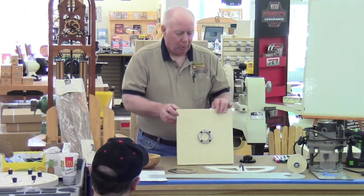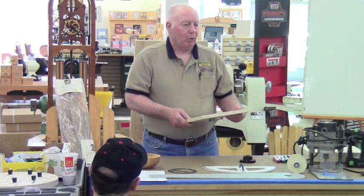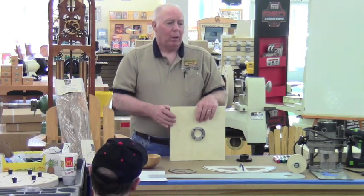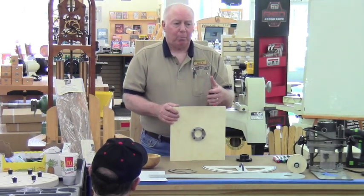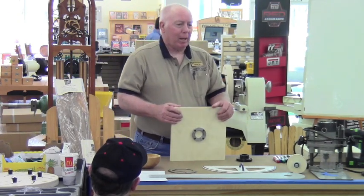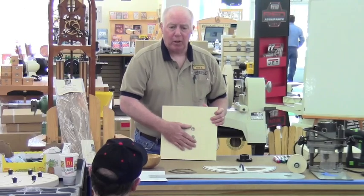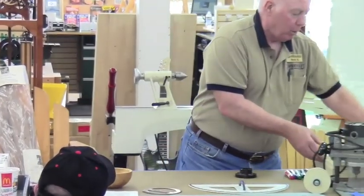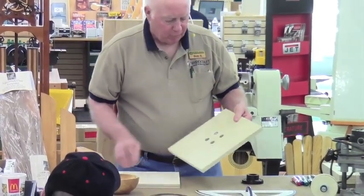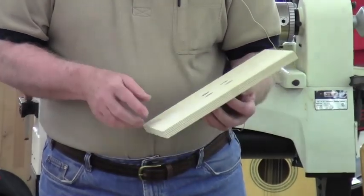We're making these things out of Baltic birch plywood — you'll find plywood with about eight jillion different layers in it. When you fasten one of these devices to your wood, you can use wood screws, but I would not recommend it because they could possibly pull out. As you're turning, if you get a catch, you could delaminate it. What I do is use T-nuts and countersink these flush, because it's going on another piece. You have to take a Forstner bit — it's best to drill these holes on a drill press because they have to be pretty accurate, otherwise your bolt won't go into the T-nuts.